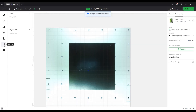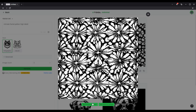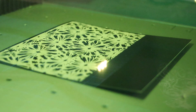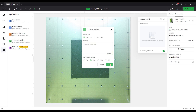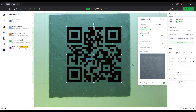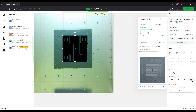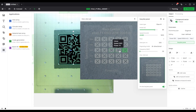The XCS software also has an AI image generator specifically designed for laser engraving, since it can output laser-friendly images or even vector images. With just a few clicks, you can import the image into the software and engrave it right away. The software can also generate barcodes. I went to engrave one on a dark slate stone. Since the engravings on stone produce lighter colors, I had to convert the image to vector format and invert it by drawing another rectangle around it. Selecting the correct engraving parameters is very easy, as a lot of settings were already prepared by the XTool team — it is just a matter of clicking on the preferred engraving effect.